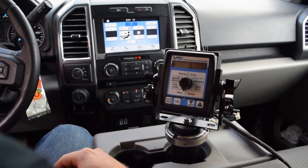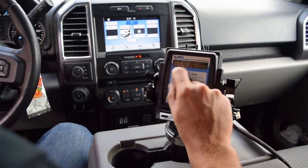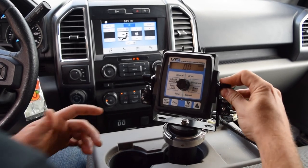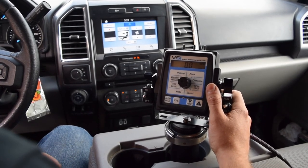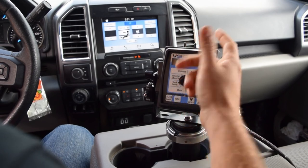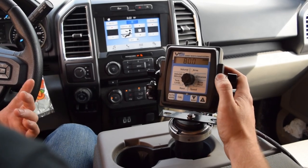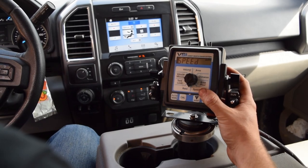The nice thing about these electronic units is when you turn them on, you can hear the pump kick on — so whenever this controller is on, your pump's running. Running through the settings: Volume tracks how much you've sprayed per account per season and you can reset it easily. Volume per minute is your instantaneous flow rate — as you go faster, the GPS system and servo will provide more flow to the boom, so you'll see this number increase with speed and decrease as you slow. Tank level monitors your tank — we have it set to 50 gallons right now. Rate per acre is what we're focused on here; we're going to run 80 gallons per acre, which is a post-treat number since we have the post-treat tips on.